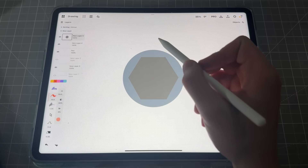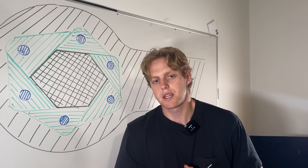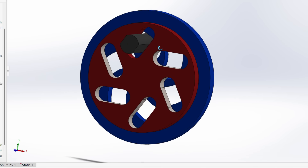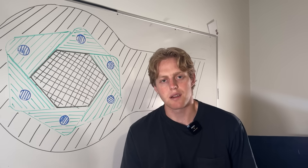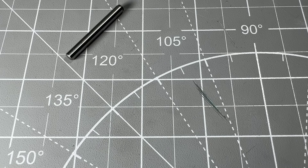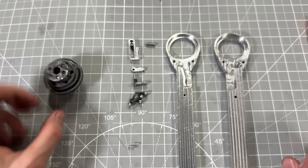This is one of the advantages of a socket — as the hex bolt tries to rotate within the socket, you have the tensile strength of the material holding itself together. I know where I went wrong, but I wasn't confident I could easily fix it, so I picked the project back up after taking a few months off. Taking a step back is often how I end up finding clarity. I think with a smaller adjustable range and larger pins I could get rid of this problem completely. But in the interest of avoiding redesigning the entire mechanism, there are a few small changes that could save me: I can shorten the length of the pins, reducing the leverage on the pins themselves, and replace the 4130 steel pins with ground 52100 hardened steel pins. I'll be very surprised if these pins fail — something else will definitely break first.